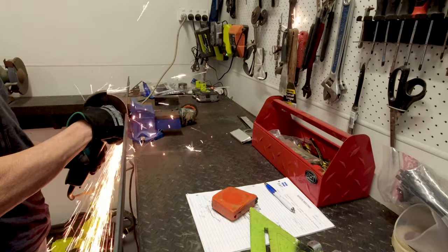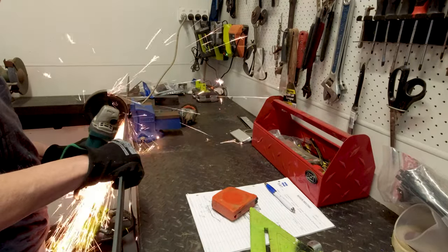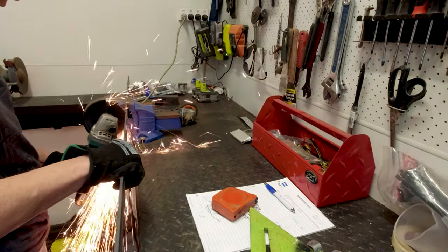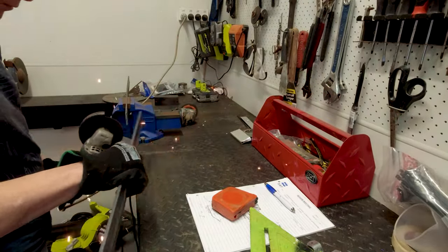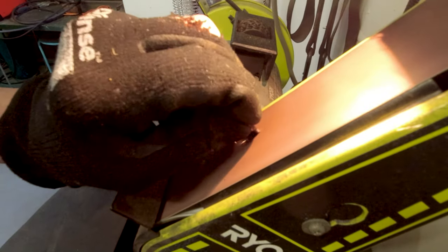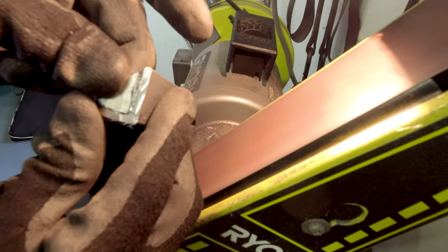The storage frame is a pretty simple fabrication using 40x40mm steel angle iron with some 40mm steel flat pieces to create a cradle that the Weber feet fit into, in both a storage position and then widthways in a cooking position.